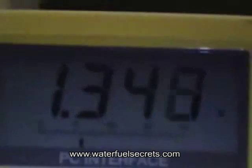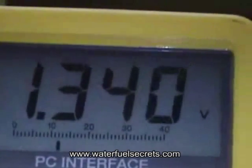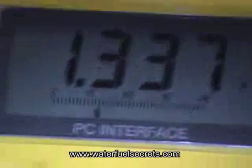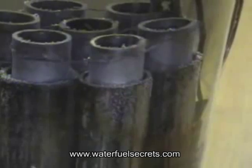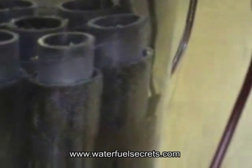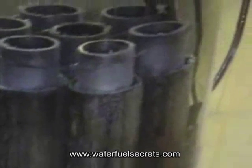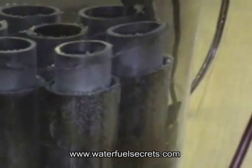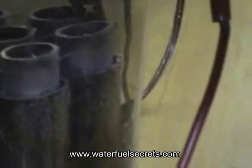I'm going to measure the volts — you can see the voltage right here is 1.343 volts, dropping a little bit since I had it on for a second. Even if you take these tubes out once they're conditioned, drain the water, put them back in, and measure the voltage without doing anything, it will automatically have a voltage. The conditioning process gives an inherent negative potential to the negative tube and a positive potential to the positive tubes — a low and a high.